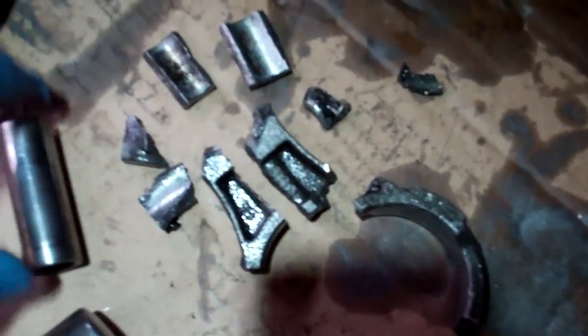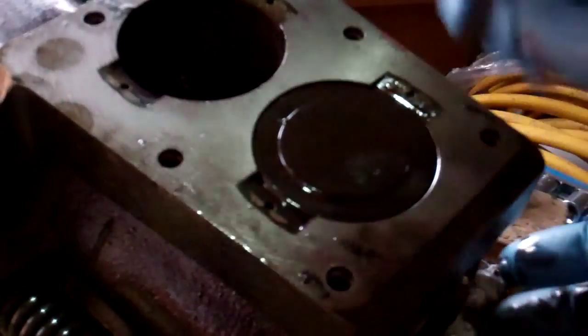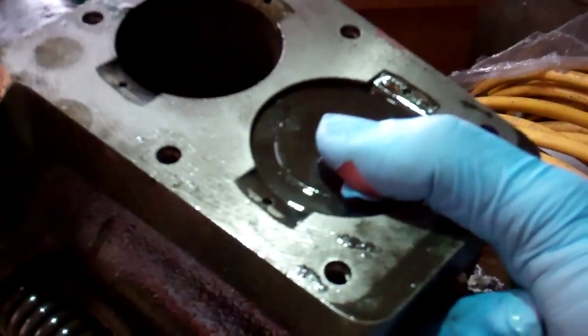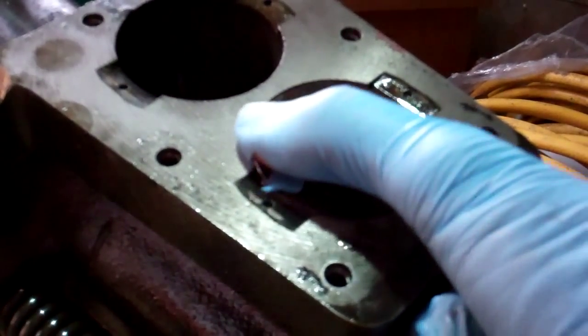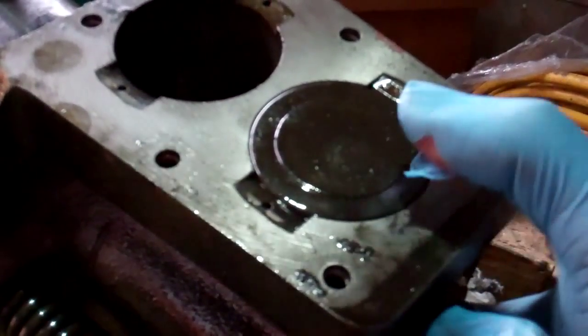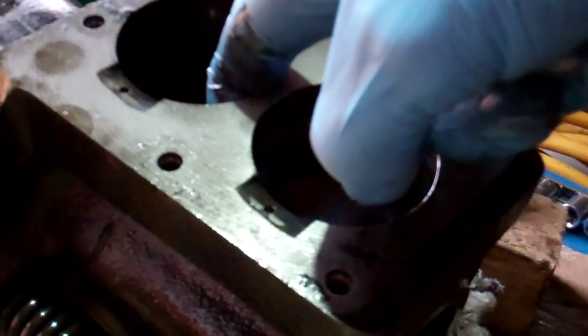What made that little end crack might have led to it splitting all the way down. That's the groove inside the block — you can just see two lines on the other one; the other piston's starting to go the same. That's got about a good millimetre or two of movement, so you can actually push that up above the height of the block at the top of the stroke — it could be hitting on the head or the valve at the top of each stroke. So whatever went on in this cylinder was starting to happen in this one too.